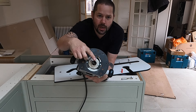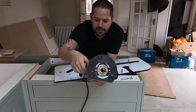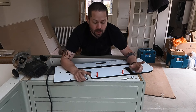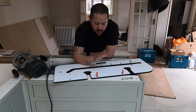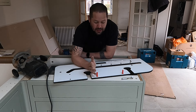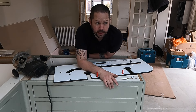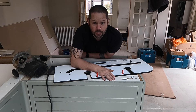You're going to need a 30mm guide bush fitted into your half inch router — that's to copy along the jig, but we'll go into more detail about that later. You're also going to need a worktop jig, or at least a bolt hole jig. If you're doing a square edge worktop, just a bolt hole jig will do. This one's only got two bolt holes in — most have three. It was about 30 to 40 pounds, it's a Unika one, made in the UK, which is always good.